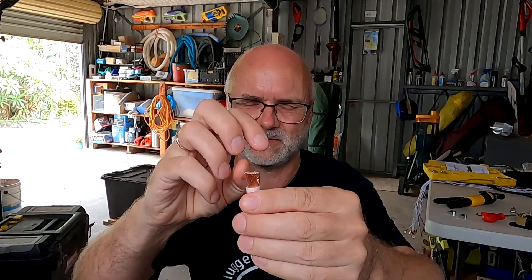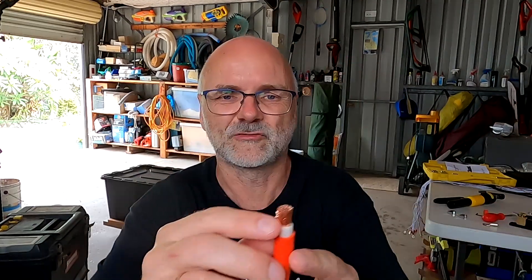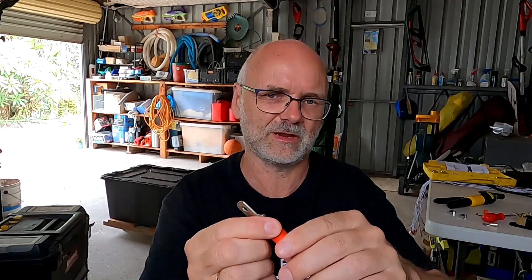Now I'm in a dilemma. I've got the better ring terminals ordered so they may take a couple of days, but what about the cable cutter? This is what I did yesterday with the hacksaw — don't cut the cable with a hacksaw because the end gets crushed and gets a lot thicker. I was actually able to manage to put this cable into the bevel mouth ring terminal, but there was no way to put it into the other terminal. You need a good quality cable cutter which makes a diagonal cut so you can feed the cable into your ring terminals and crimp them correctly.